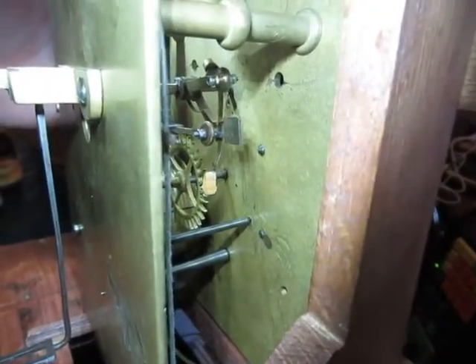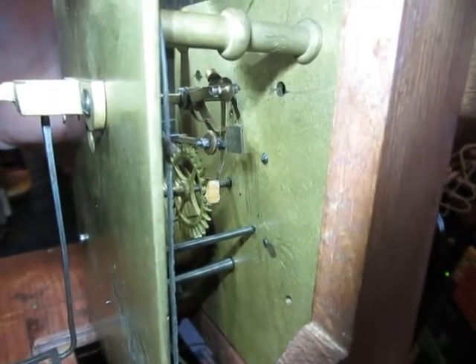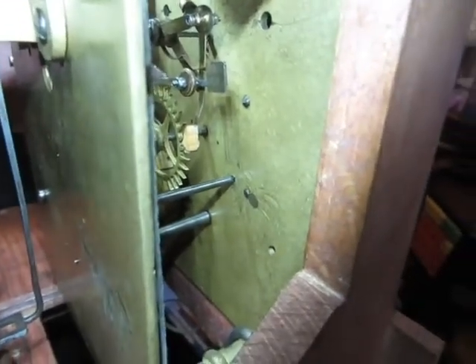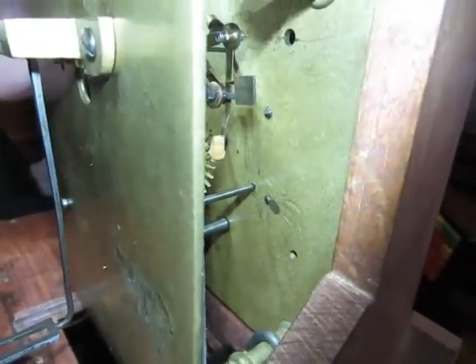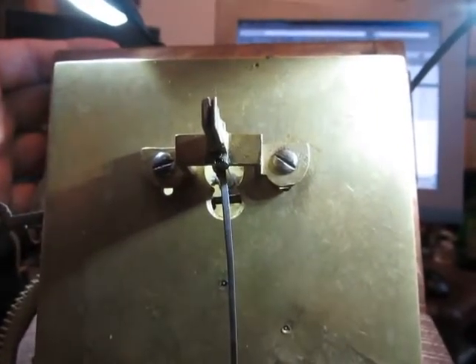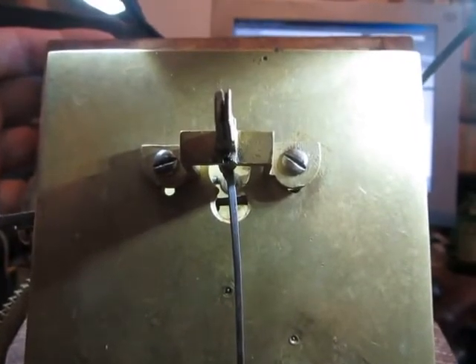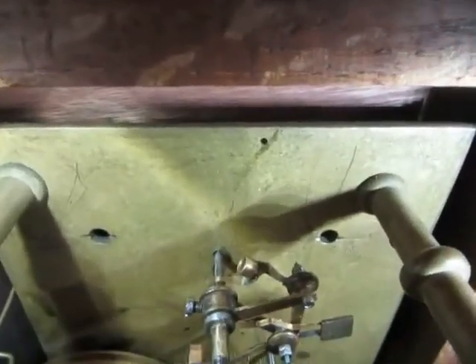The whole movement is very strange. There have been pivot holes drilled and then filled in again for no apparent reason. There are hammer marks on the plates and odd casting flaws here and there. Most interestingly, there have been two different heights for the pallets when this clock was being made — two sets of holes for the screws holding the pallet bridge, and obviously two corresponding heights of pivot on the front plate. You might not see them very well in this.